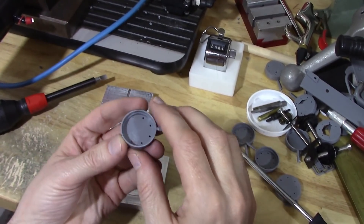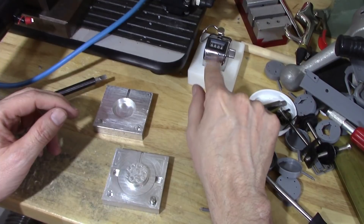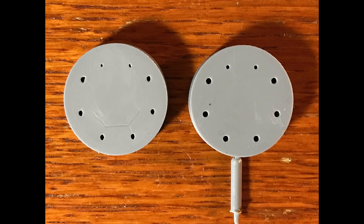No flash — it turned out perfectly. I'm going to keep doing it. I have a counter here to keep track of how many I've made. This side-by-side view shows just how much of a difference there is between the old mold half and the new mold half — with the new one you can see that the holes are perfectly round. I'm very happy with this and now I can go into production. Remaking the mold half was a lot of fun because I'm using my upgraded lathe with the TTS collets and the power draw bar, which made changing tools a whole lot nicer. The tool offsets were already in there too — just a pleasure to work with.